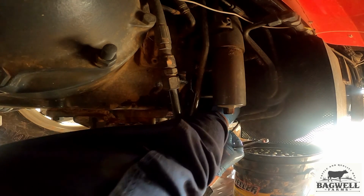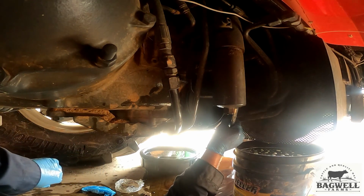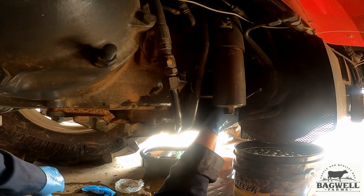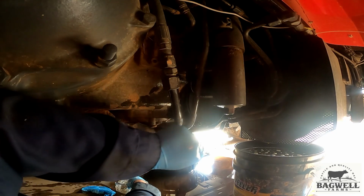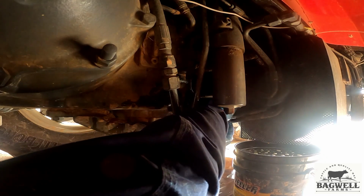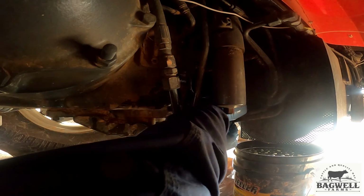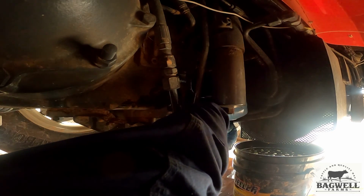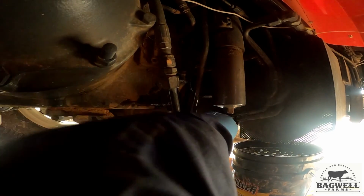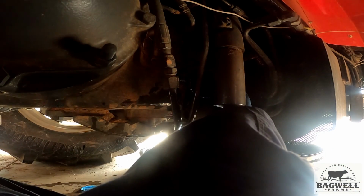And what else did I get? A cabin air filter, and I got this one, and then I bought stuff for the 5100 too. I got a big can screw on hydraulic filter for it. I replaced the strainers back in the spring. It's due for the side filter now. I didn't have quite enough hours on it to change it from the last time it was changed, but now it's due. And it's like this thing now, I don't have to worry about this job again for 2,000 more hours.